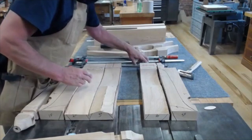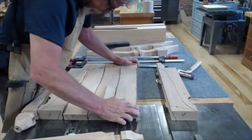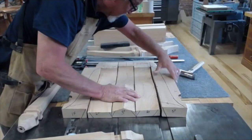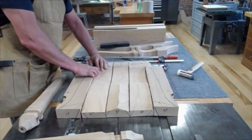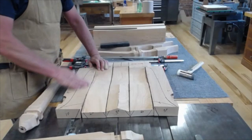I think you kind of get the idea of what's going on here. Once we have number 2, 3, and 4 timbers sculpted, and this number 5 and number 1, in order to get this contour, you could bandsaw it if you were really talented with a bandsaw on edge. I'm not. I use an angle grinder with 50 grit sandpaper and sculpt it out when I'm sculpting the whole thing. So once we get this joinery in place,